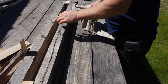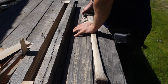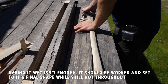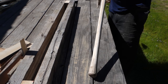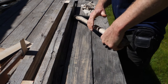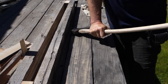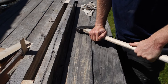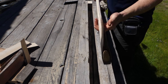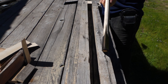This handle is nice and hot now. The head is so hot that I can't hold it, so it's pretty hot. I need to work quickly because I only have so long before it cools. I'm really going to loosen it up this time — I'm really trying to stretch the fibers on the tight side to loosen those up while it's nice and hot and wet. I don't know if you can see how much that's flexing, but it flexes a lot. Basically what I'm doing is limbering up the fibers so they'll be more likely to stay where I put them. Now it's bent too far the wrong way, which is pretty much just what I wanted. I'm going to keep working it until I get it just about where I want it.